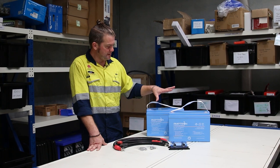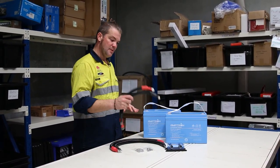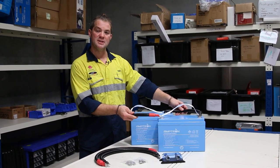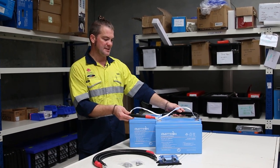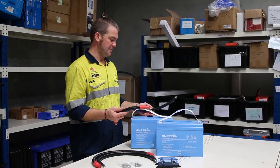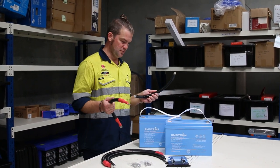There are always two batteries. They all have a 175A continuous rating. With two batteries linked together using the included cables, you get a maximum continuous discharge of 350A from this battery bank, and a combined Ah rating of 200, 300, or 400Ah depending on which batteries you choose. You can only choose matching batteries — two 100s, two 150s, or two 200s.